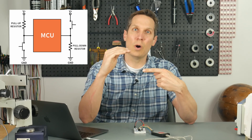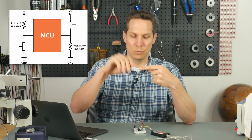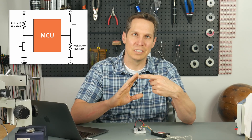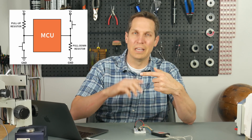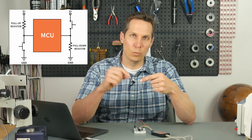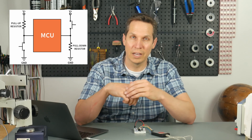It's typically high to VCC, but you don't want to tie it so hard — you don't want to directly tie it to VCC — that you can't change it. What we're doing here is we're going to have the input connected through the internal resistor that ties it to VCC. So whenever nothing is acting on it, it will read high, but then the button will short it to ground and draw it immediately to ground. You want your pull-up resistor to be a large enough value that when you are tying it to ground, you're not drawing a lot of current straight from VCC through that resistor.